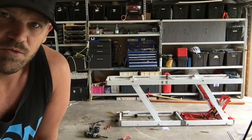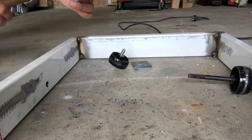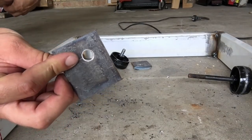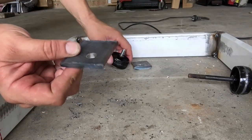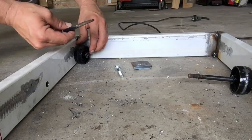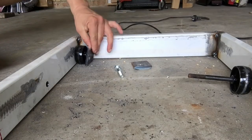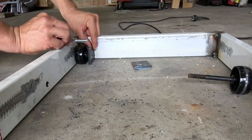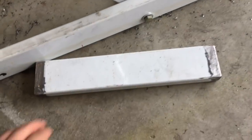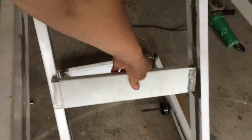For the wheels, I've just cut two pieces — they're 60mm long. I've measured so that the wheels sit pretty much on the corners, and this is just going to be welded to this part here, straight in like that, and then the bolt's going to go through and hold those wheels. Another thing I've done is cut this piece, which is going to be the cross member to sit just in there.